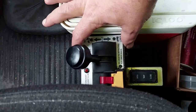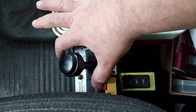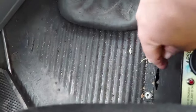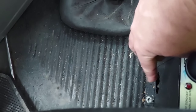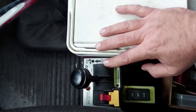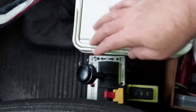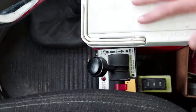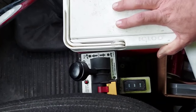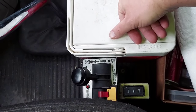And sometimes you'll get where hydraulic oil comes up through your tower. It'll usually come up through your switch, or it may come out on your floor. So look for that. If you get that, then you've got a cracked pump. He told me there was hydraulic fluid leaking in the floor, and he said that's not possible, that can't happen. Well, it can happen if the pump cracks.